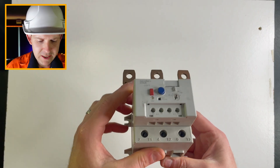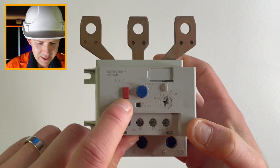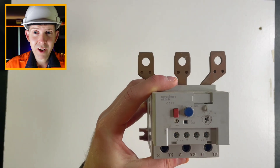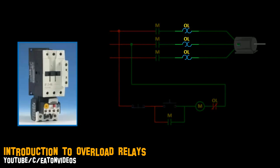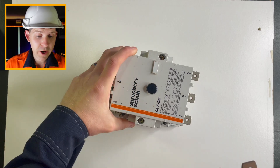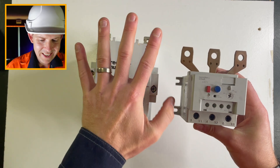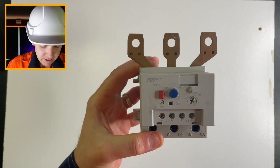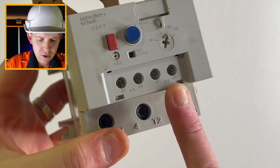On the face here you've got a couple of buttons. The red test button tests the trip mechanism to see whether your auxiliary contacts are working. Something a lot of people don't understand is this actually doesn't break any load — it's made to detect an overload at a certain range and then cut out your main contactor. The power going to the coil of the contactor gets interrupted via the overload, which detects through these selectable auxiliary contacts — a normally closed contact and a normally open contact.